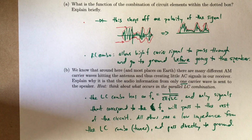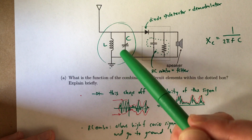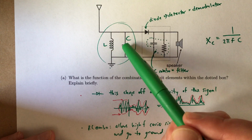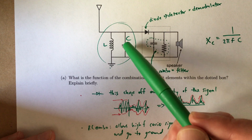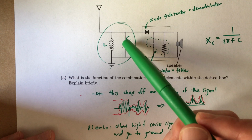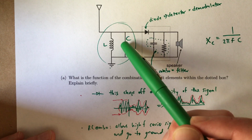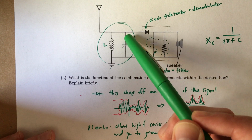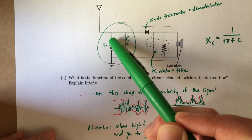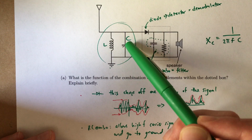Okay. And we talked a little bit about how that resonant frequency expression comes about. We didn't derive its form, but we talked about how if you were to separate this from this circuit and charge up the capacitor and just watch what happens in terms of the current and voltage here, you would get this oscillation in energy. It's part of the reason why sometimes it's called a tank circuit. It's like water, the energy in the circuit is kind of like water sloshing back and forth in a tank. So you've got first energy stored in the capacitor that causes current to flow through here, which at first gets opposed by the inductor, which limits the rate at which it comes off of the capacitor.